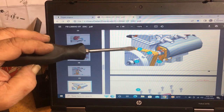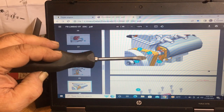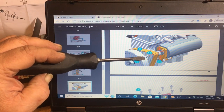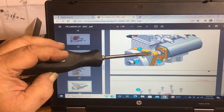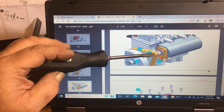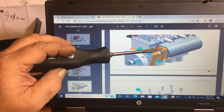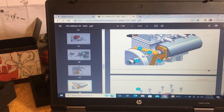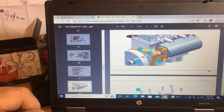But if you take the belt, number 40, and your 52 is your screws, you need two of these, you need two 11s, slide everything together loose, get the belt on there, and then you can tighten all this stuff up. Now there is a flat spot on this shaft here for the starter motor, so you're going to want one of the grub screws to be on the flat spot, and that way it'll tighten up nice and neat and shouldn't have a problem there.